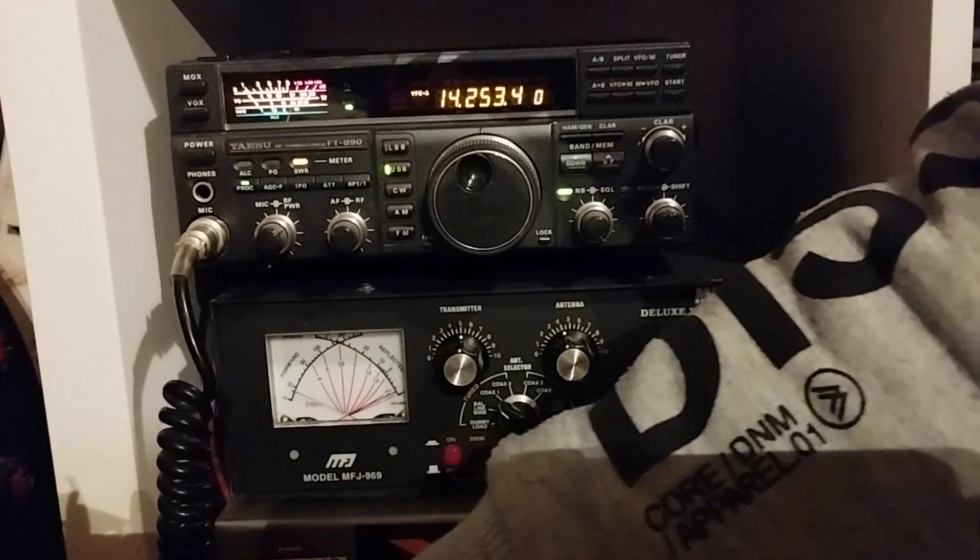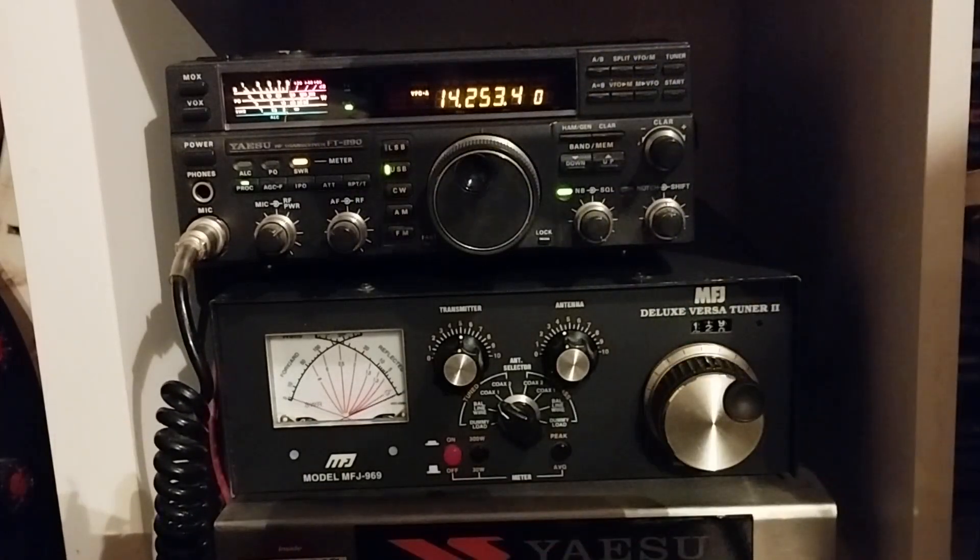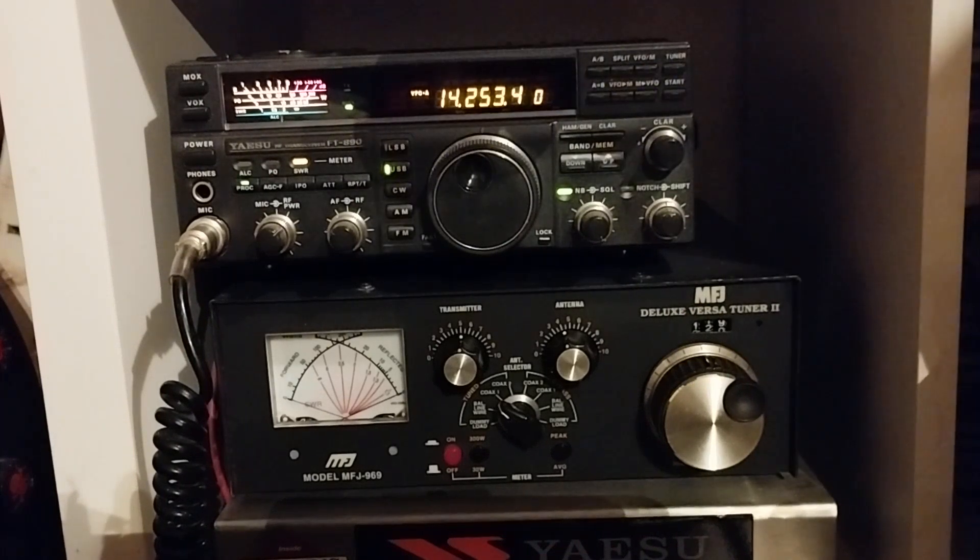Patience pays off! I'm only running 100 watts — happy with that one. Patience is a virtue and the homemade delta loop seen in action, not even resonant yet, properly tuned. That was just with the ATU trimming it up a little bit, 100 watts with the classic Yaesu FT-890. I like that radio — obviously my first transceiver, still working well for me. I'll have to get a bit better with the tuning, I've not done it for a while — a little bit rusty. But it worked out in the end. Seems to be working great on 40 meters as well — I'm surprised just how nice it sounds.